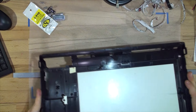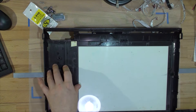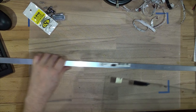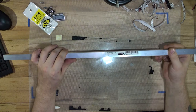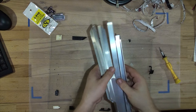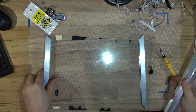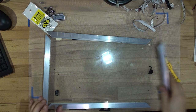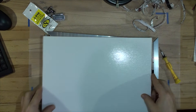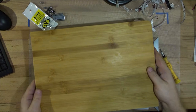Let's start by taking the glass out of this printer scanner — that's where you can salvage your piece of glass. We'll also need a U-shaped aluminium channel to make the enclosure — 16×16×1.5 millimeters, pre-cut into four sizes to make a square box. The glass is slightly smaller than the frame so it sits on the springs. The top is a piece of plastic holding the LEDs, and the bottom part is a chopping board cut to size — the aluminium box is precisely the size of that chopping board.